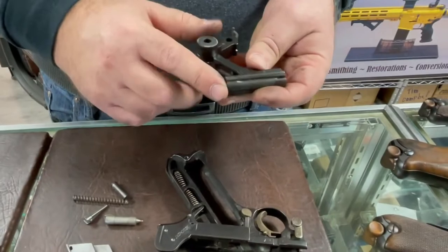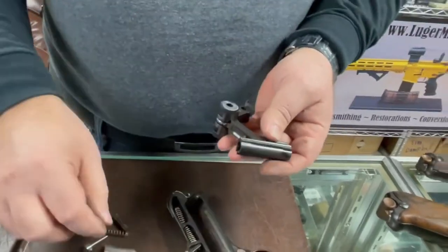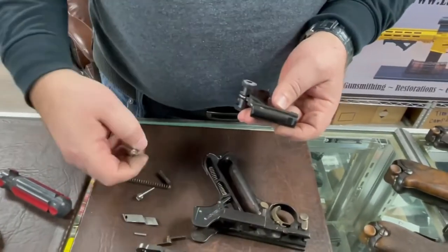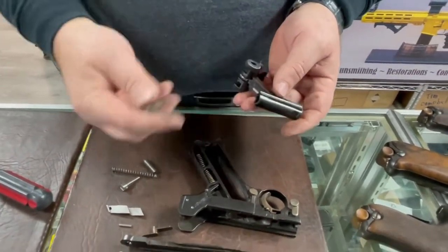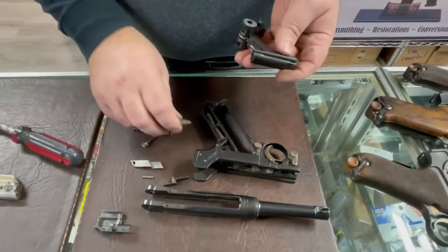In this pistol there is a potential for puncturing the primer with the firing pin. When the primer is punctured, gases escape through the hole inside the bridge block, propelling the firing pin like a car piston — it hits the spring very hard, then the retainer hard. Eventually the retainer wears down, the bridge block bulges and chips, and the engagement spot wears away. If you see any degradation, we always recommend replacing these early firing pins with the fluted WWII-style firing pins.